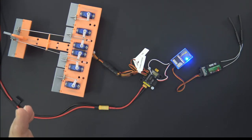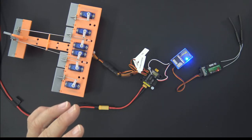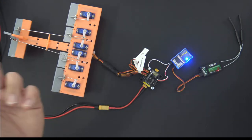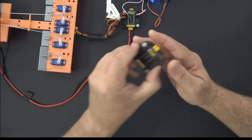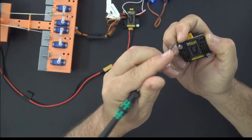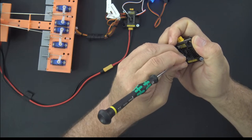So it can also be used, it is an advanced Y harness, so one channel to, let's say, flaps can have like two or three servos on that one flap. Yes, exactly. That's exactly the idea. It's a rudimentary bridge or mixer. So if you have several outputs that you want to react to one signal, let's say you have four things that you want, I already have four of them set up. I have eight, actually. Let me move these back.